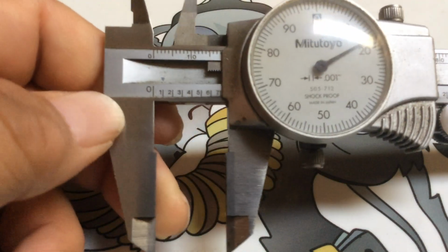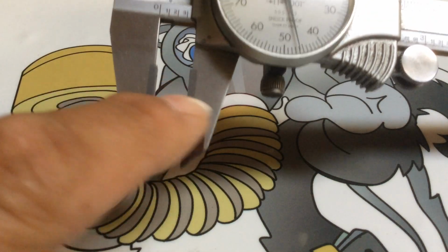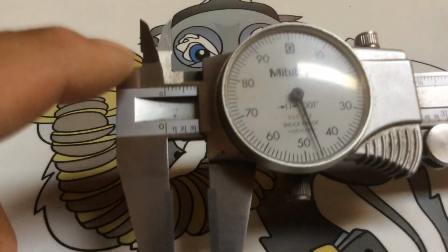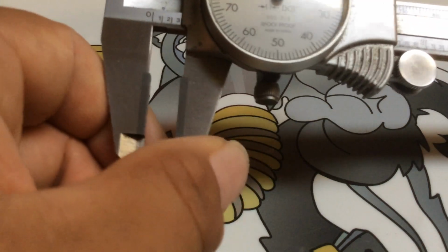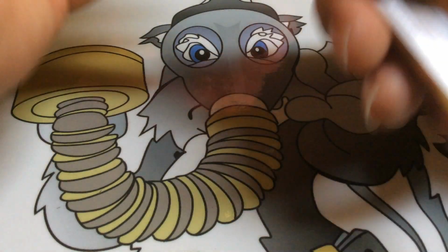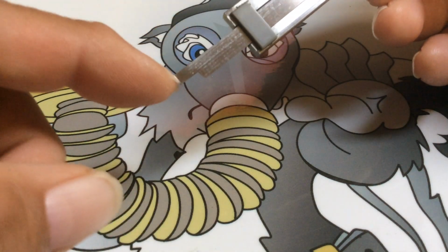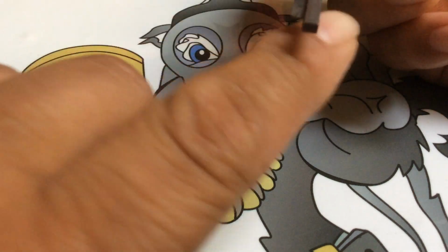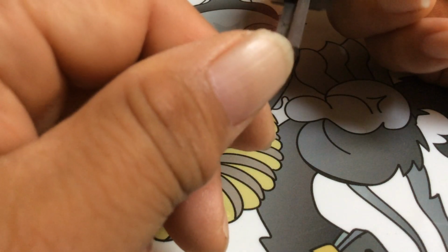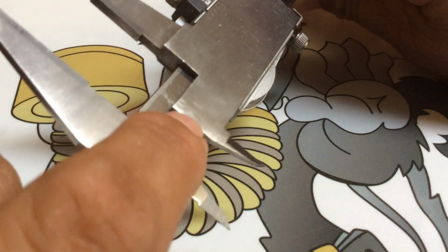If you're a first timer, you don't know which one to buy. I recommend buying the one with the carbide. Here, carbide ID, I call them rabbit ears. And your OD here. And now on the depth mic, there is no carbide. Let's see, where are you? Here. See, it's just the regular high speed. But you indicate these by the edge right here, the two landing, and the tip. And then on the step, which is hardly ever used, but it's the landing here and the edge right here.